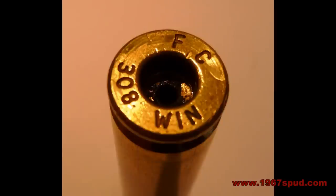Here in this picture you can see it is a classic example of over pressure. If you look at the top — this is the case head. Looking at 12 o'clock just to the left of the F, you can see a small indentation caused by the extractor. And if you go to 3 o'clock you can see just below and right of the C a slight mark where the bolt face has caught the back of the case. It is over pressure in the case that has forced the actual case head back into the bolt. Just between the F and the C you can actually see more indentation.